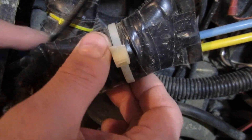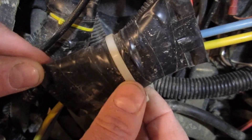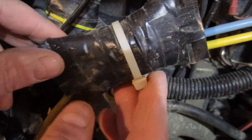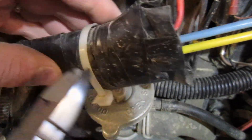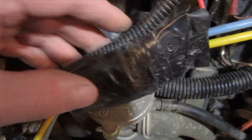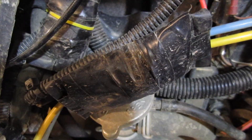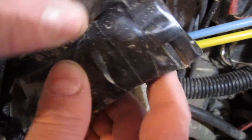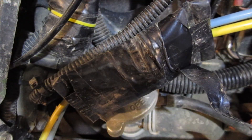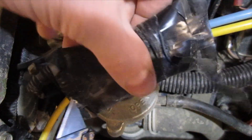You can see I've already been into these — these are the infamous breakers you may read about in the forums. These are the bags that are supposed to keep moisture out, but they don't do a great job; they actually do a better job of keeping moisture in. When you submerge the wheeler or leave it out in weather, moisture gets into these bags and corrodes the breakers. I replaced mine with an automotive breaker, which was recommended by someone at the Polaris dealership.